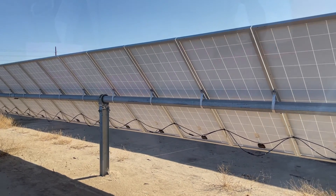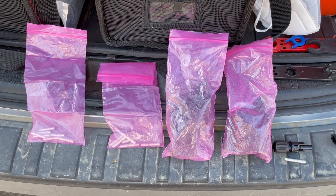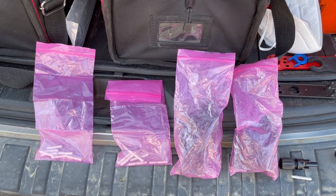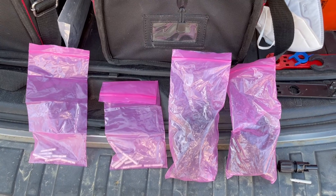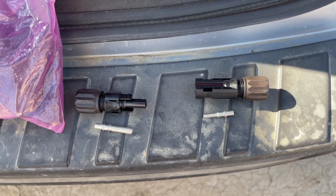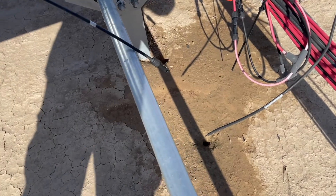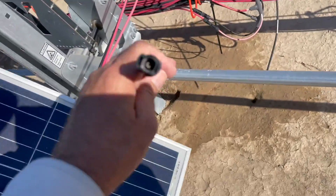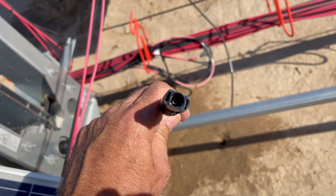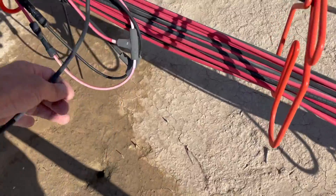Every inverter on this site came with eight male and eight female spare MC4 connectors so you could make up your home runs — plug them into the bottom panel-mount MC4 connectors on the inverter. We've got thousands of these spares. Here's one male connector with a male pin and one female connector with a female pin. I just have to install them on the ends where they fell apart. Even though the wire only pulled out of one, the pin inside looks toast — charcoal-looking — so I'll replace both the male and female. I can see probably why: look at how extra long the wire is.